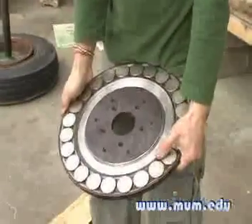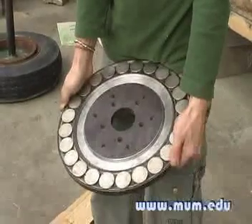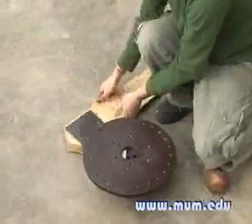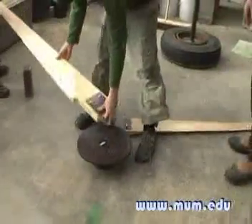These are the magnets. The students machined that and set the magnets in place and calculated how many magnets they needed. This disc basically directs the blades — you flip it over and the blades mount directly on there. It's a very simple, robust design.